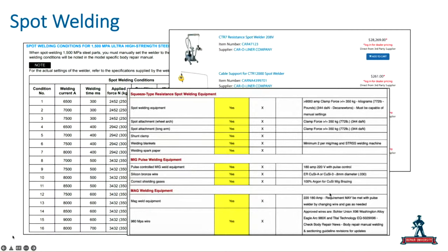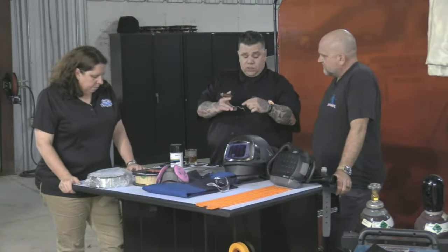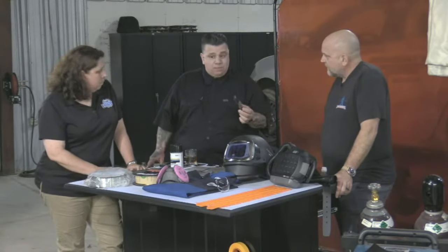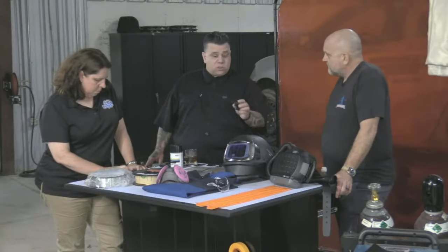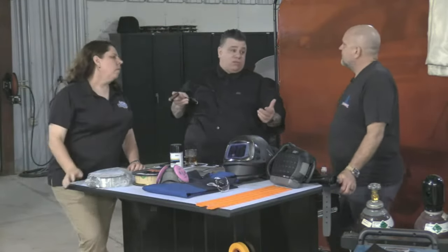One thing you have to remember when you do practice welds: here's a plug weld, but a resistance weld will be similar. It's going to give me one round circle. I have two choices. I'm either going to twist this in some cases. In a lot of cases, I'm going to peel this. And in some rare cases, I'm going to have two welds and I have to do a wedge, which is what Honda requires. That's great, but you don't know how much force you needed to pull. Kristen's going to pull at a different force than you and me, and you and me are going to pull at different forces. Unless you have a lap shear type puller with a computerized program to tell me how much force, I don't know how much force it is.